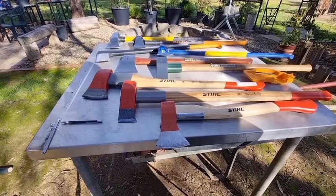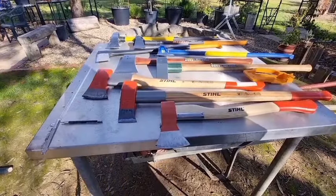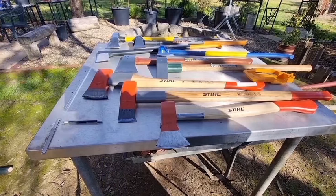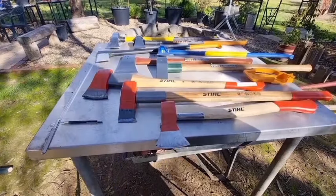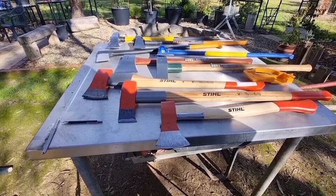So obviously if that angle is over 30 degrees, you would find that the bevel angle would be 40 or 45 degrees. I don't like to go over any more than 45 degrees on this beveled angle here, because I find out it's harder to penetrate.